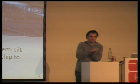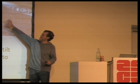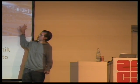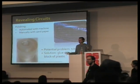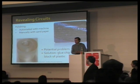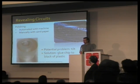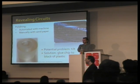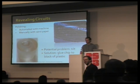The goal is always to be as planar as possible to the backside of the chip, so that you only ever see one layer at a time. If you don't get that perfectly, that's fine too, because once you have enough pictures from one layer, and then maybe across different cuts, you can still reassemble it. So you don't, in your first cut, have to get everything down to one layer. You can, with your next chip, try again, and eventually you'll have full coverage of each layer. Does that make sense? Cool.